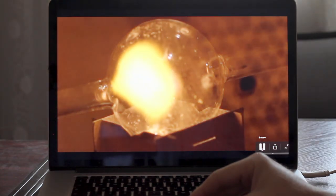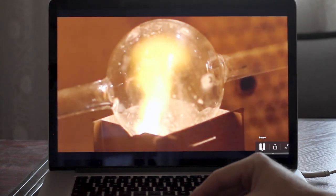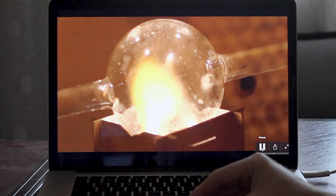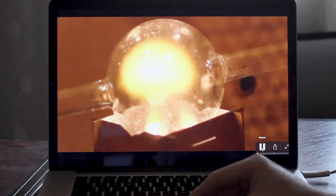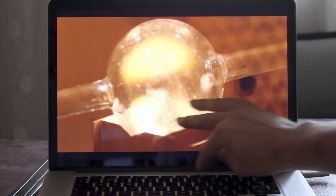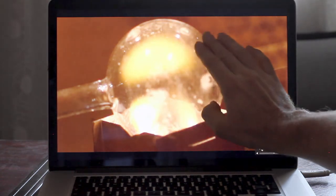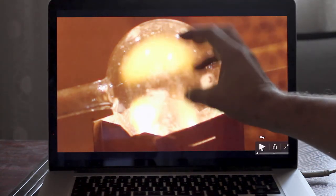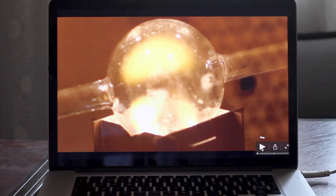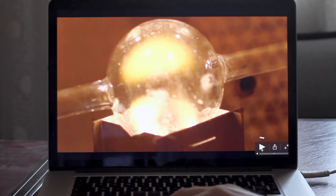So you see, at first you don't fill the whole spherical cavity with plasma, only partially. Later, when the system reaches an equilibrium temperature, then... So what you're saying is if the glass is too cool, you get a thermal gradient and this breaks the plasma down. Of course, it cools down. And so you need to get the glass to a temperature, and you mentioned that temperature earlier was about 1000 degrees. Yeah. Otherwise, it will cool down and the plasma will vanish, of course.